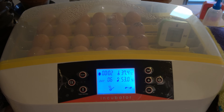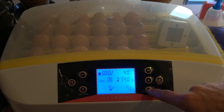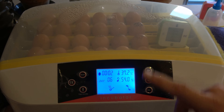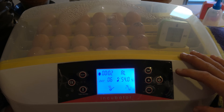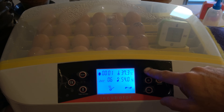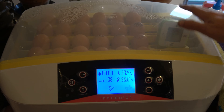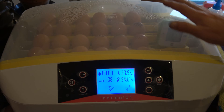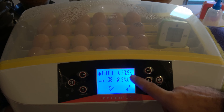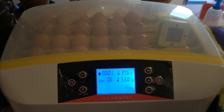There are no other settings — only these three key settings. One: set up your target temperature. Two: if you have a humidity alarm problem, go to the humidity setting and set it to 1, then save — no more humidity alarm. Three: do the calibration setting. This is the most important one. Put a thermometer inside, put a hygrometer inside, and check for a week to see what's happening. Calibrate every day until the built-in display and the internal thermometer show the same reading.